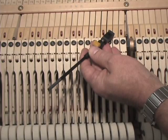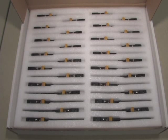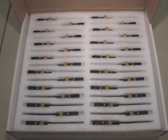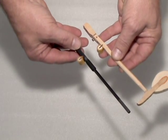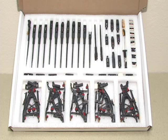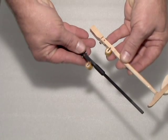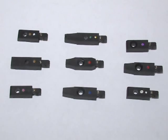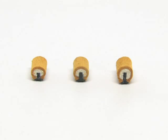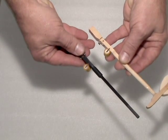You'll need to determine which shank and flange configuration is best for your piano. If your piano matches one of the pre-configured sets, selection couldn't be easier. Before ordering, confirm your selection by comparing the old part with the new part. The Wessel Nickel & Gross sample parts kit includes shanks and flanges from many pre-configured sets — compare parts from your piano with the kit until you find a match. Confirm that the replacement includes the proper flange for your action rails, appropriate knuckle location and diameter, and that the new shank center pin is in the same location as the old one.